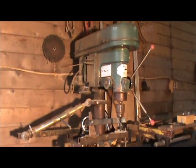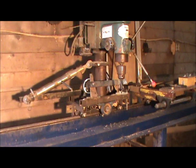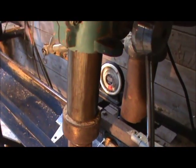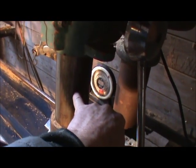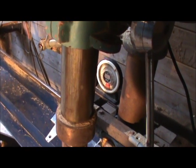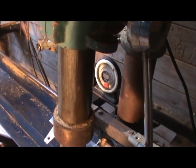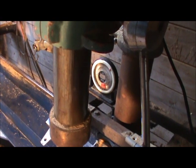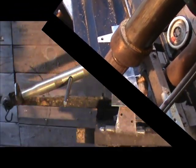It's also got a drill press — this was a floor model, about six foot tall, and I cut it down. The reason I use this drill press is that most drill presses only have about a three-inch throw, but this one has about a six-inch throw. That allows me to do the angles much easier and also drill further into the log. With a three-inch one, unless you were just doing light furniture, you'd probably run into trouble.